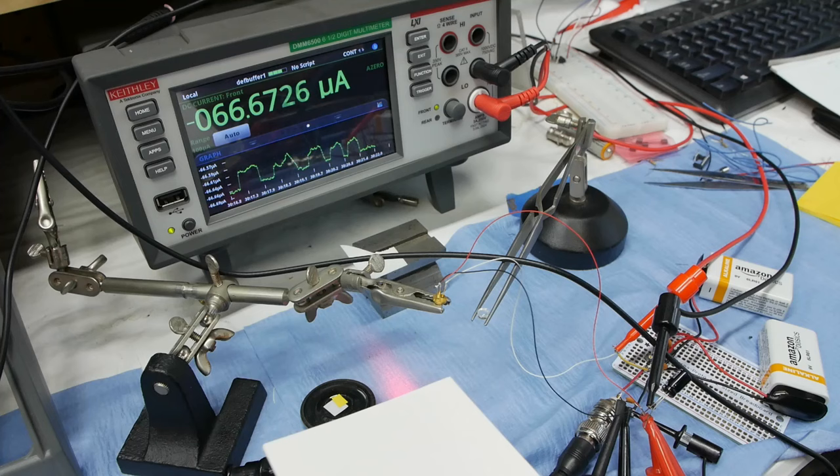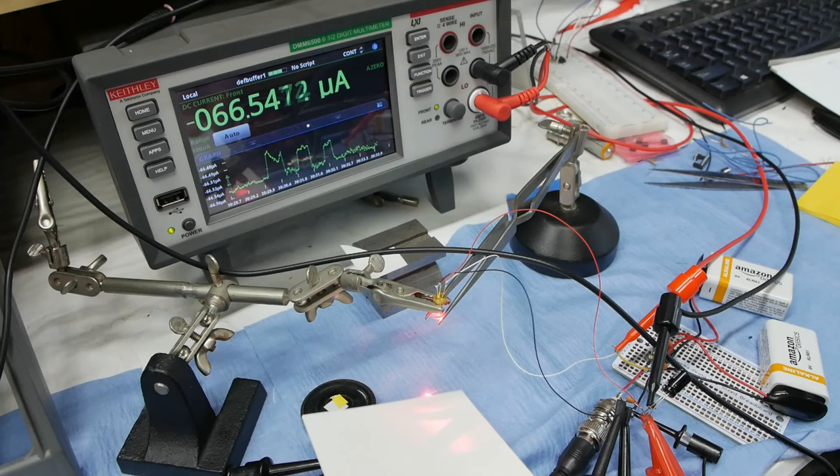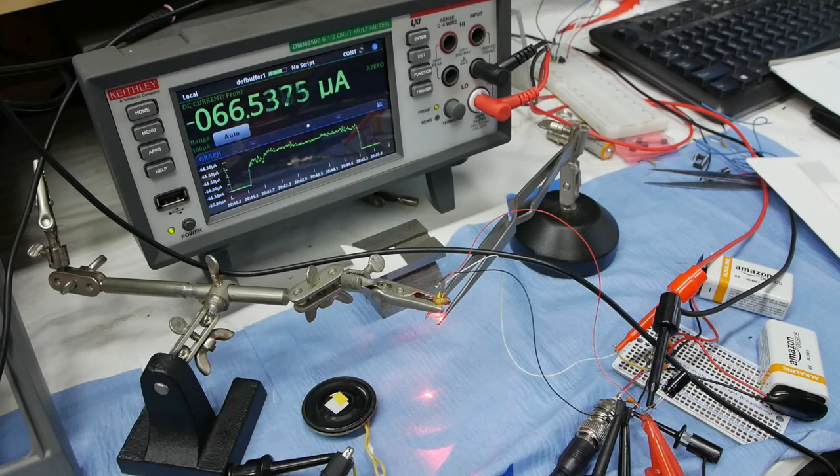There's no sensor other than the laser diode itself. And if we add a lens here, the effect works at a longer range because the lens is collecting more light coming back from this spot. And if I use a card with a retro-reflector on it, now the signal is pretty massive — about 10x bigger because the retro-reflector is sending all that light back in.